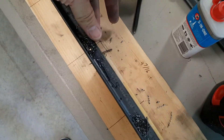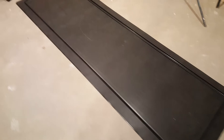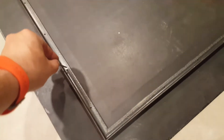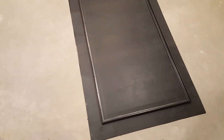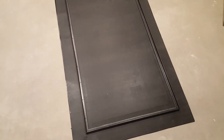The membrane is going to go between the frame across this way. We have the frame, we lay it out on the membrane. First, make sure that everything is spaced properly, then use a little screw and push it down into the holes — that leaves a mark as an indicator of where the holes are going to be. After this I remove the frame, do a rough trim because there's so much excess on the sides, then use a hole punch to punch out where I've indicated with the screws. You can see I've punched out all the holes.